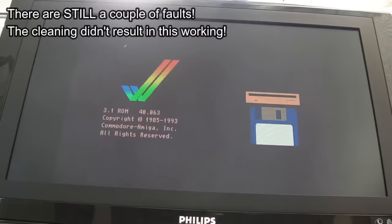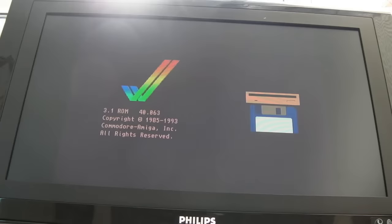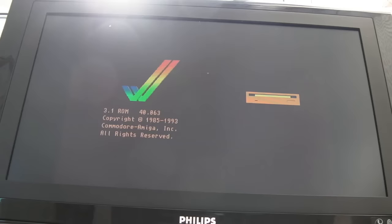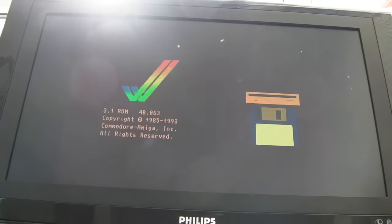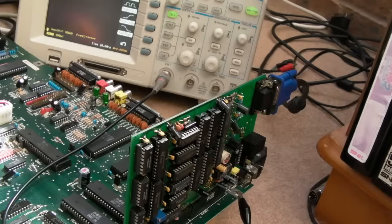Look how yellow the water is from the ultrasonic. I did spend a few days — an hour or two over several days — checking things: the logic probe, swapping the same chips around. The 163 counters and RAMs you could swap around. If you had a problem with the RAM the colors would look wrong — you'd have pixels out of place, lines, flickering specific to certain colors. Swapping chips resolved nothing. Now I've got the scope set up and I've been scoping around the 564 PLL.